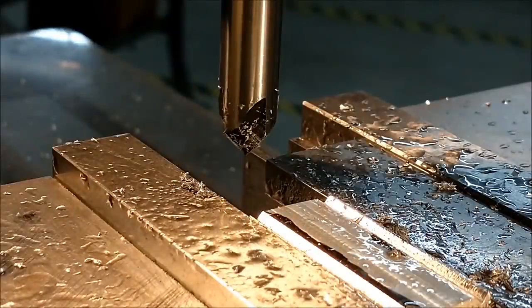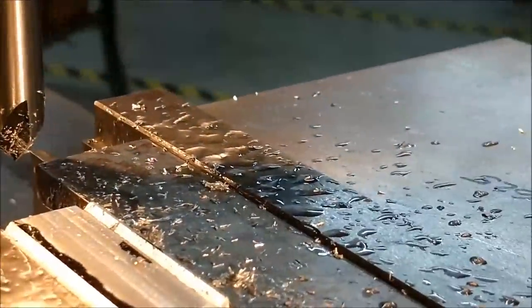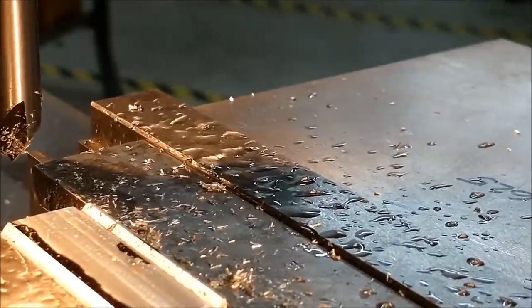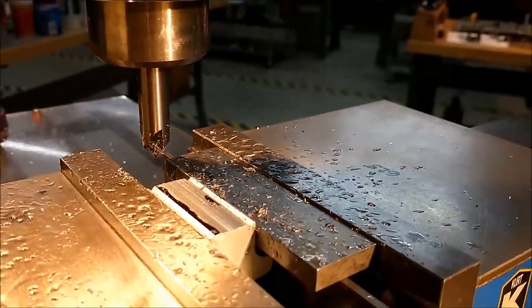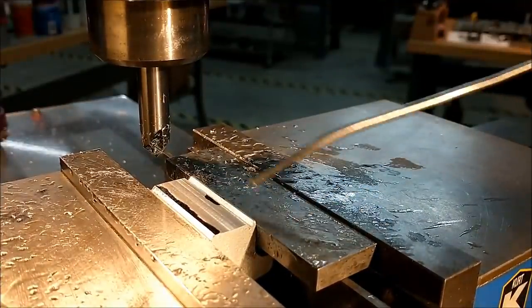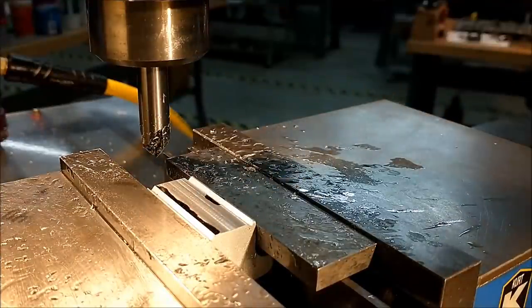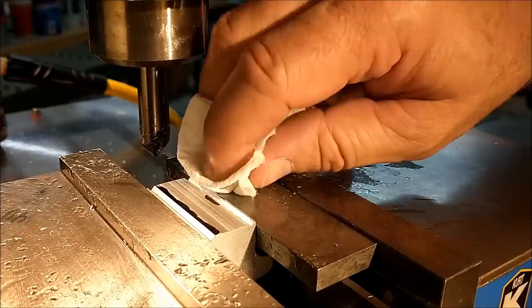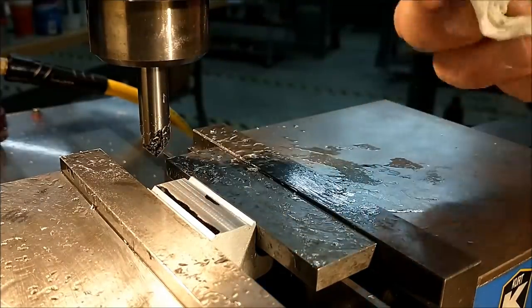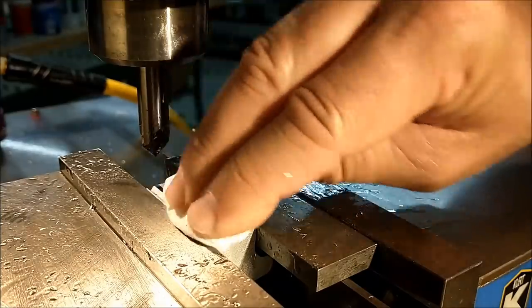All right, let's lay a pin in there, put a gauge block on it, track the top, see what we get. It may be kind of hard to capture this. Oh, no, it won't. Anybody with good eyes can see the difference in the outside land between the front and the rear. That is the 10 thousandths offset that I put.